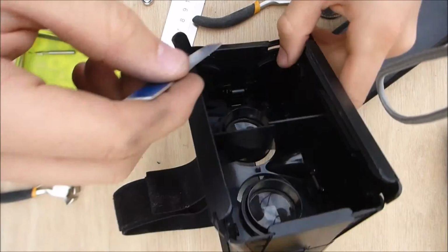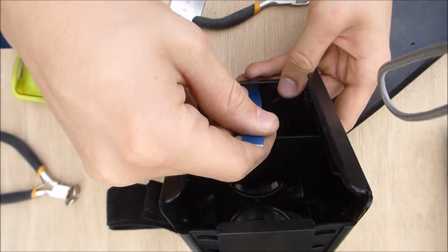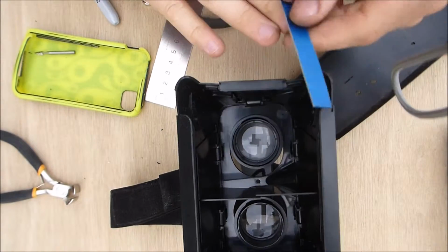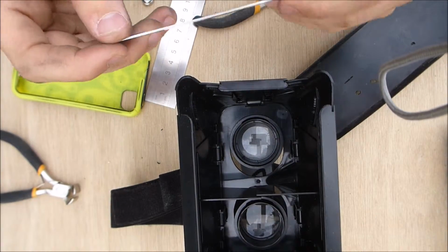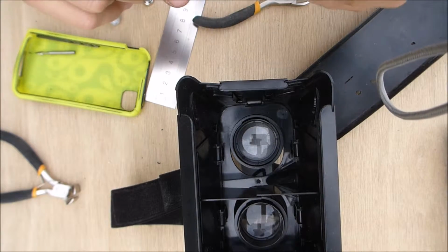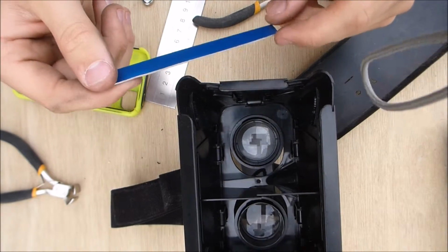So as it turns out, that gap where that mark is just about 1 centimetre. So I'm actually going to file this down again now. I'm going to use another Dremel bit. I'm going to file it down to just a little bit smaller than this, maybe like a millimetre off. Knock a millimetre off and then it will fit perfectly.